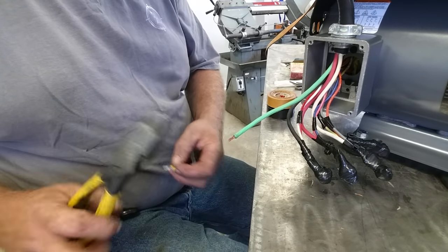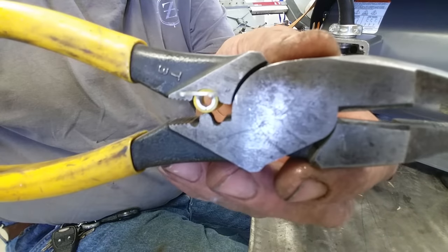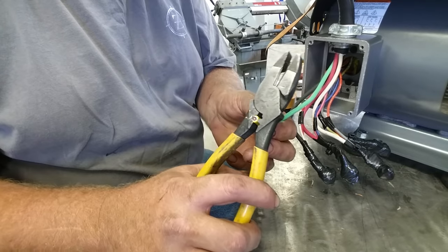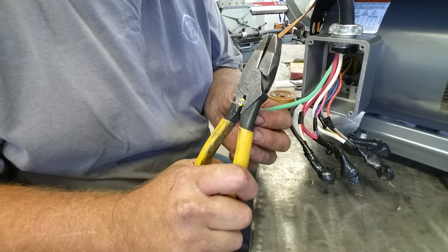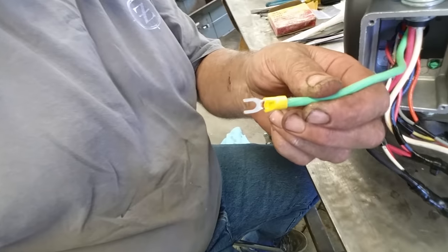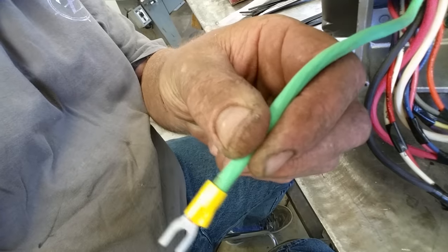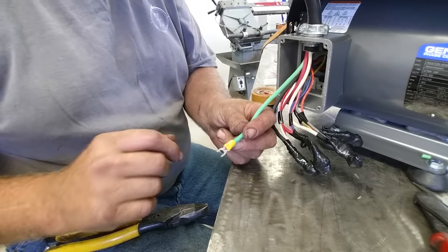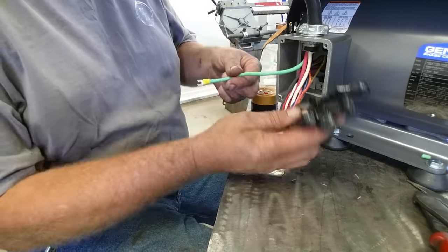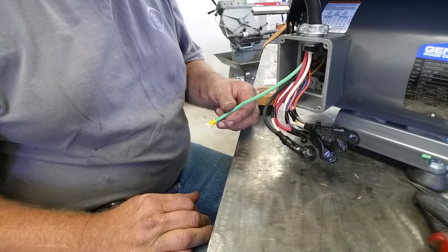Load your tool with the stake at the top where the break is, drop your wire in, check the other side to make sure the wire is flush, and you've got massive leverage. You'd pull the wire in half before that crimp comes loose. Good solid connection with Noalox. Now we're ready to fold this up, put it back in the pecker head, cover it up, and do the field wiring for the rest of the RPC.